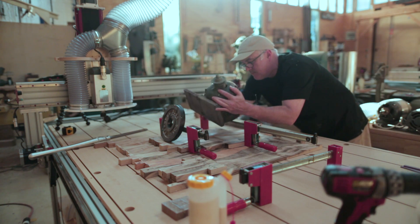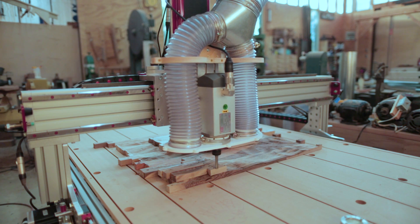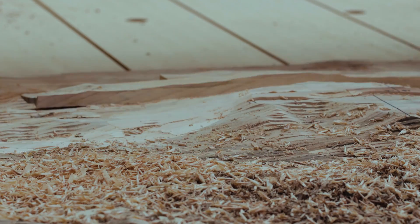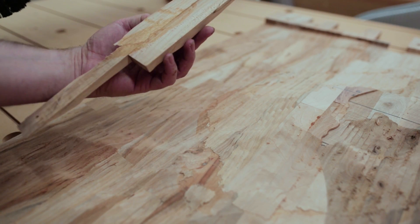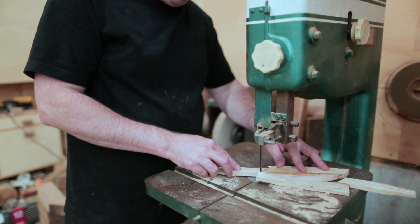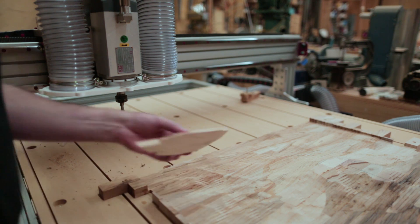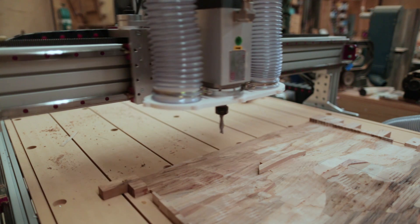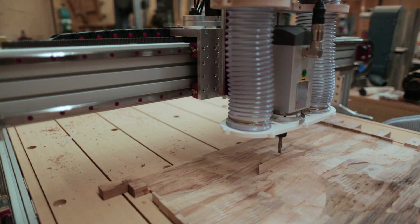Once that's set I can take my clamps off and carve the second layer. The carving so far is just a roughing pass — using a big half-inch bit to remove most of the material without worrying so much about the surface. I got to the end of the second layer and the piece broke off. I was leaving too much extra material on the secondary levels — they're just extra for the router to carve off, but if they get long enough they can have enough leverage to break the piece free. So I carved off the extra bit and re-glued the piece back down, using the CNC as a clamp to hold it in place.